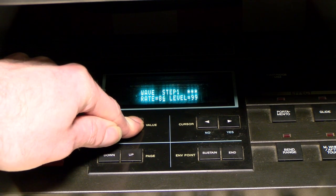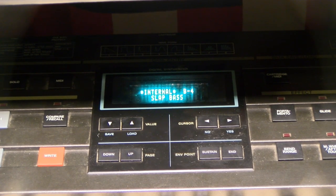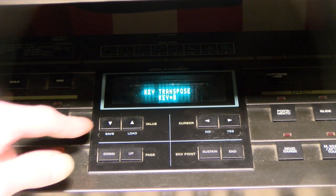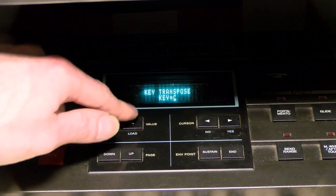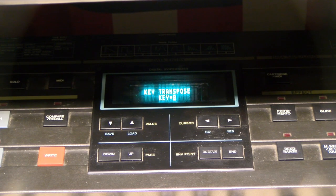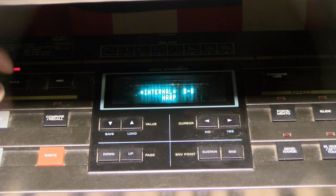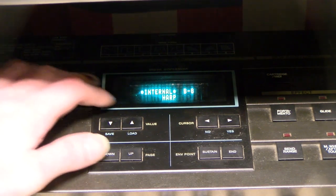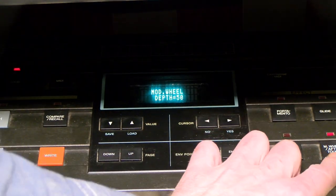Provided it has the same line and column count, you can do this to most any device using this type of display, so long as you can provide enough power to run it without blowing something up. I can't recommend doing this modification to the CZ-1, as there is every chance it will just kill the power transistor and destroy the instrument, but the temperatures look correct, and I do doubt the original, now disconnected EL driver was really ever all that efficient itself, so it might be breaking even. And if you're confident in your soldering and wiring abilities, then that may be the fail-safe option.